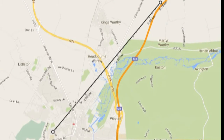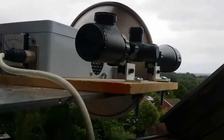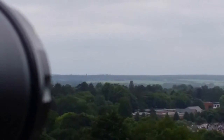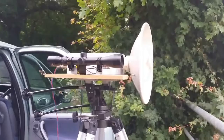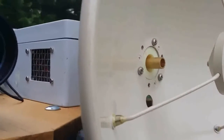Performance tests had already been made along the length of the garden and just over 400 meters down the road. Now it was time to try along the path — the map shows a previously used 134 gigahertz test path. The transmitter is set up to look out of the loft window with a clear takeoff to the reception point. A quick reception test is performed in the garden and the telescope crosshairs are aligned correctly on the dish. The equipment is then rigged at the far end of the test path at Strona Wood, looking back towards the transmitter at the home QTH.